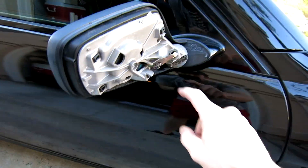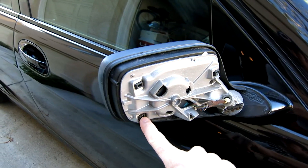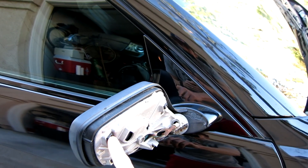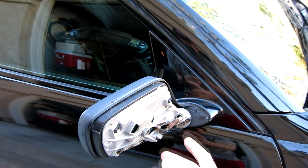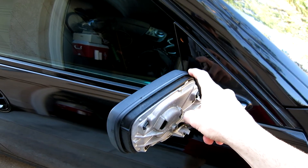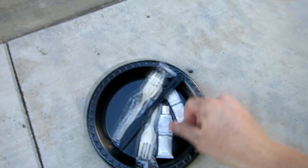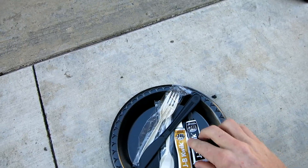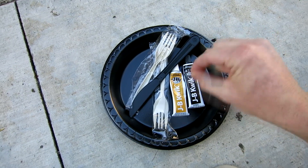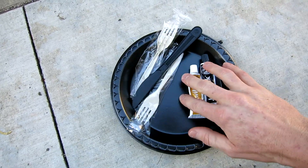I'm going to show you guys how to fix this. Unfortunately some of the clips are actually stuck in there — I think two of them — but there are clips that are still good, which is a plus. Now if you don't have any clips you're going to have to use more JB Weld, and that's how I'm going to fix this. I'm going to be using quick JB Weld that actually dries black, so it's going to blend in really nicely. I have my JB Weld here and I'm going to do even parts — equal parts of each component. I'm going to be stirring it up with a plastic fork, and just use stuff you can throw away after you're done.